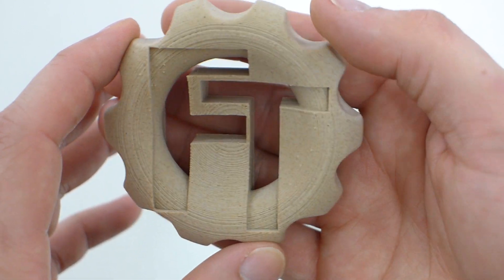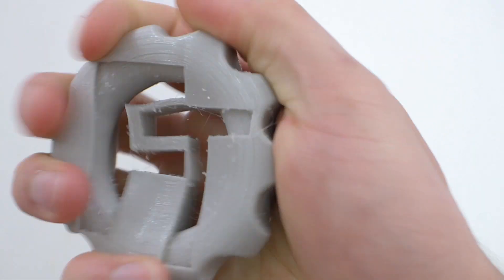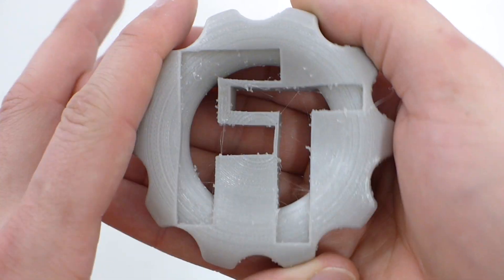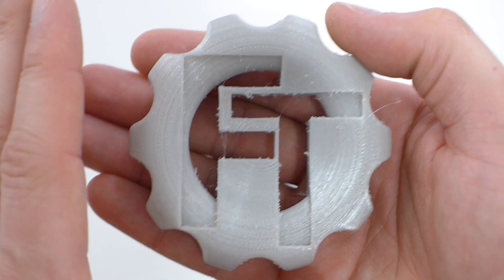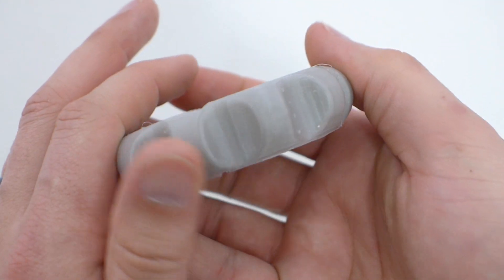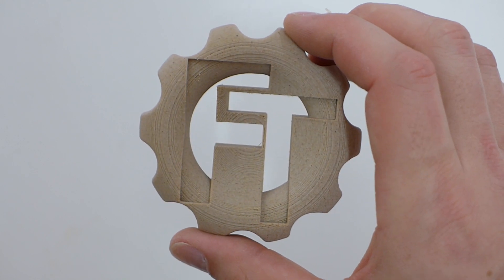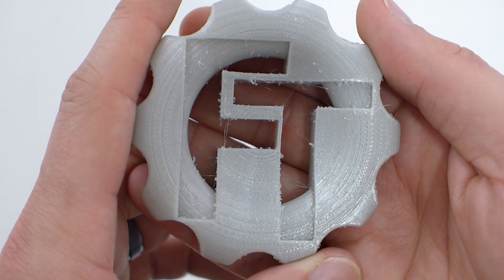Printing this filament gives an excellent aroma of wood — I just love that so much. It's so cool to be able to print with this stuff. I highly recommend checking this filament out — it worked out great, super easy to print with, easy settings, very forgiving. Now we have the gray NinjaFlex from NinjaTech, and this is so cool because you can crush it and it goes right back. This is a super flex material, not a semi-flex. It just absolutely turned out great. There's a little bit of pimpling and a little bit of stringing — I am getting better at printing with flexible filament, but I'm not there yet. Sidewalls came out great. That pimpling is a little bit of my retraction settings. This was printed at 15 millimeters a second and took seven hours.